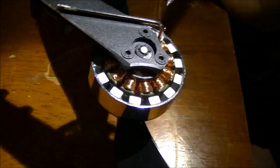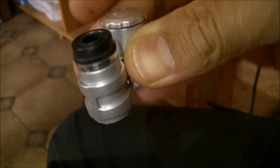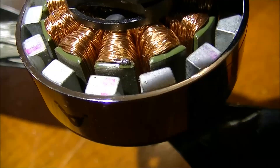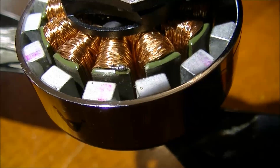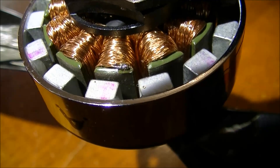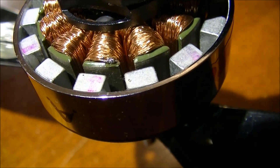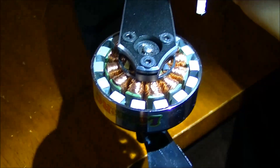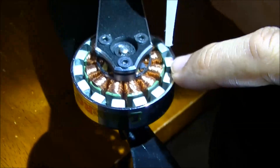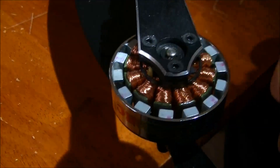I'll look at that with the microscope — this is a great little $2 microscope off eBay with a light on it. It looked like a successful connection with the soldering iron under the microscope, but I'm going to put glue on there and hold it all together, because if it gets bumped that'll crack. I'm just going to put super glue on the solder joint there — this will just hold it together and seal it up, forming a nice hard layer over it.